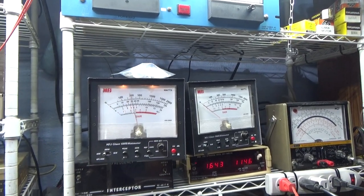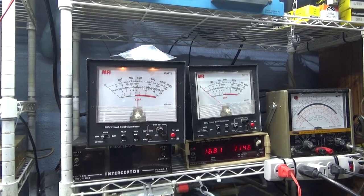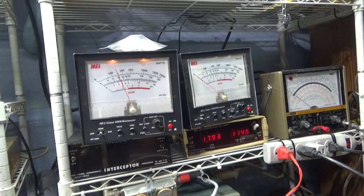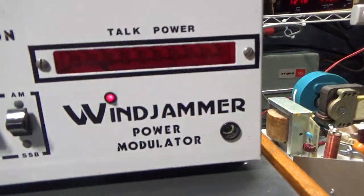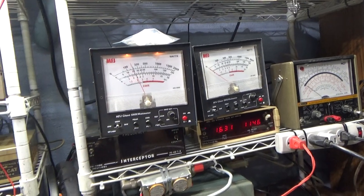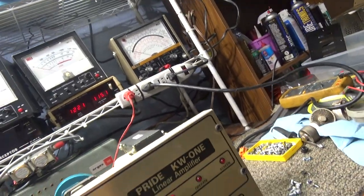We're gonna put the Wind Jammer power modulator on — still on the 20-watt scale on average. Dead keying about three watts. Audio talking about 15, and of course whistling, putting it in the corner. Going to the 200-watt scale: audio is talking about 23–24 average from a 3-watt dead key. Again, this is a nonlinear amplifier, or a modulator as I call them.